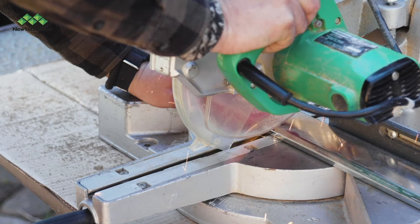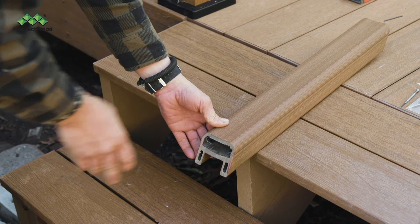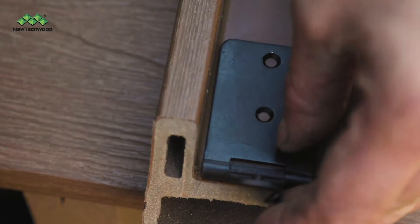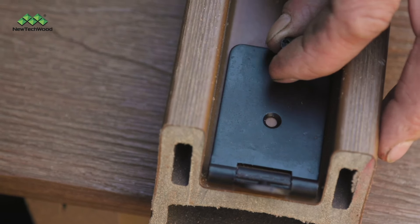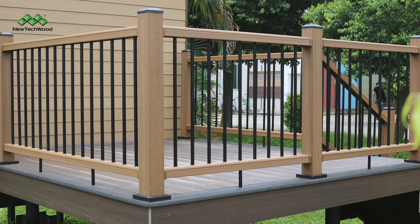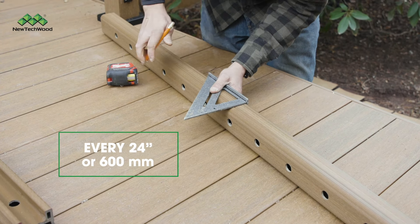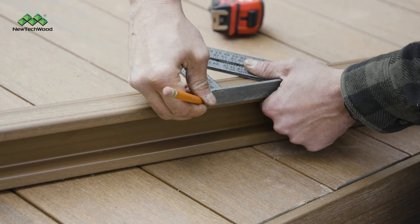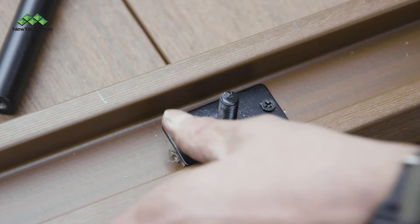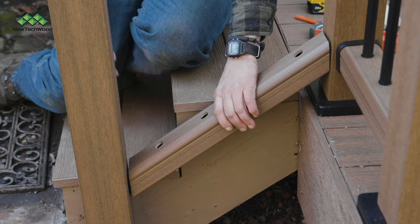Once your rail and galvanized insert are both cut, put the galvanized inserts into the rails. Now it's time to install the brackets onto the bottom rail in preparation for connecting it to the posts. Place the bottom brackets into the rail and screw them into place flush with the edge. After those brackets are installed, it's time for the foot blocks — make sure they are evenly spaced approximately every 24 inches, and make sure you're not installing a foot block directly underneath one of the baluster holes. Then pre-drill and install the bottom rail into the bottom post brackets with the holes facing up.